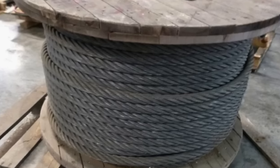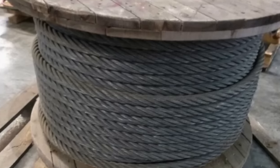And then on lift 1, our park was in the habit of replacing the cable every year. Whether it looked good, whether it looked bad, didn't matter. We replaced that cable every single year. So that wasn't really an inspect-it-and-see situation, though we had a complete cable inspection criteria that we used with the ride in operation. But when the ride was brand new to the park, one of the cables failed. Before my time, this is what I understood, the cable failed and messed up a lot of stuff. So the park learned after that, regardless of what's happening, the cables are cheap.